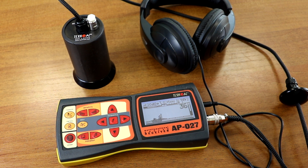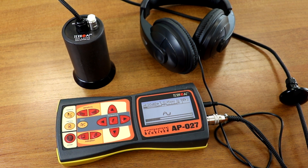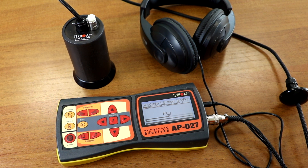To locate the leakage, we switch the indication back to scale mode by pressing the indication button once. The scale rises as the volume of the detected noise increases. We place the acoustic sensor above the pipe and wait three to four seconds. The number in the middle of the screen represents the strength of the current acoustic signal with the filter applied, and the goal is to locate the maximum value of this numeric indication.